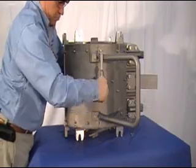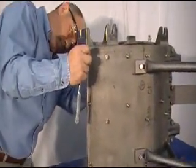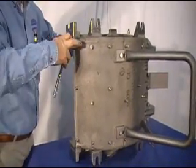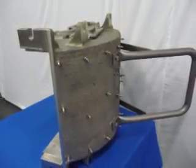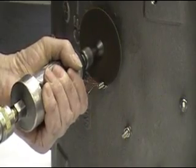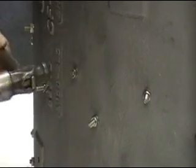This process is to be repeated starting at the center and working toward the rear of the cover for the remaining bolts. The inch-and-a-quarter long machine bolts are used to allow for variations in the liner radius. However, once the liner is completely tightened in position, it is suggested that the excess bolt threads be removed and the end of the bolts are to be peened to prevent them from loosening.